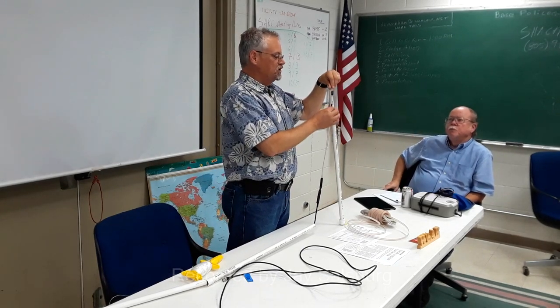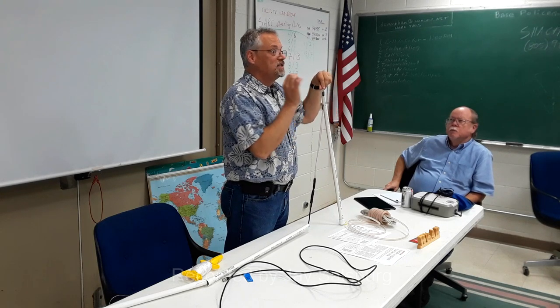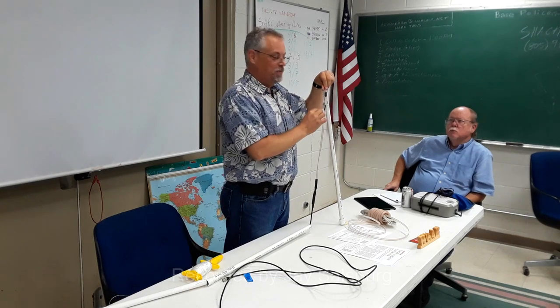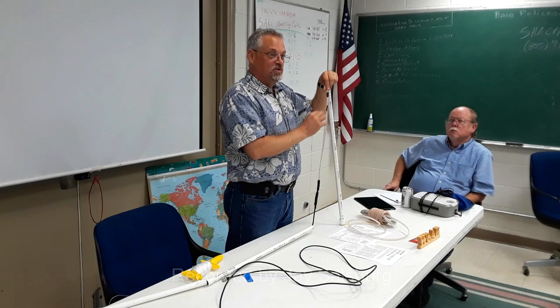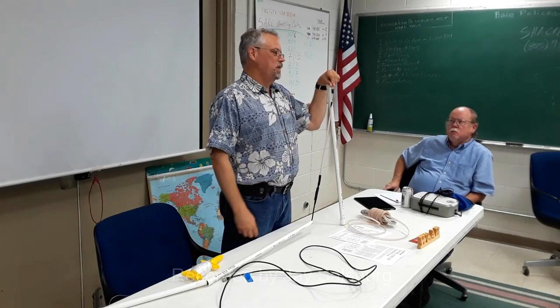So what I learned is that, yes, you can put tape on here to weatherproof it, but just enough. Don't put too much on there, because what will happen is it detunes it. Now, here's the other thing. You're trimming. Oops, I made it too short.